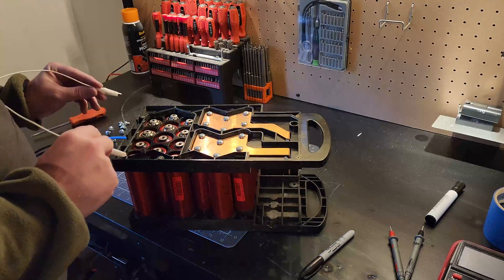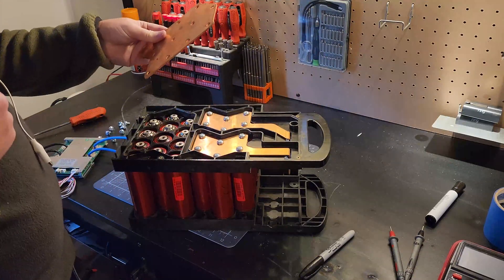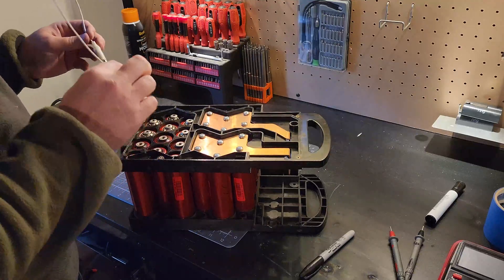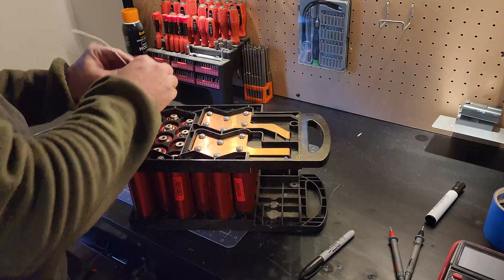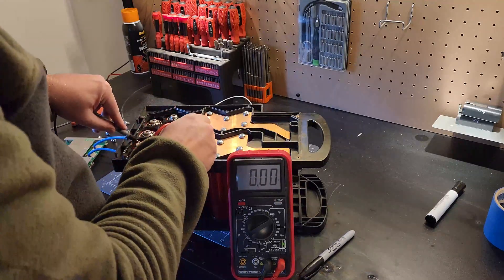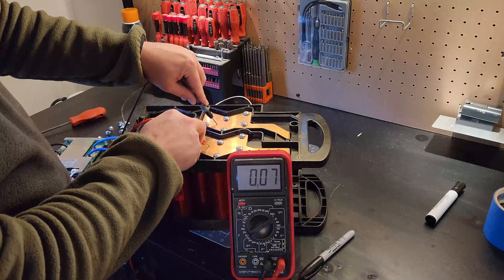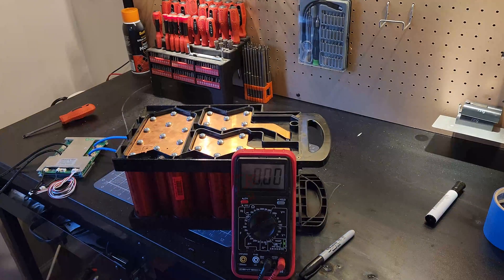We're ready to bridge, but I want to be more careful first. I'd rather sacrifice a little wire — if something is wrong it would melt and spark, and I could let go quickly rather than placing a big plate down and not being able to remove it. Let's give it a try. We're good. Doing voltage checks again: this side to this side we get 6.66V, the other gives 6.58V. Here to here we should get nothing, and once we bridge it we should get our 12 volts.